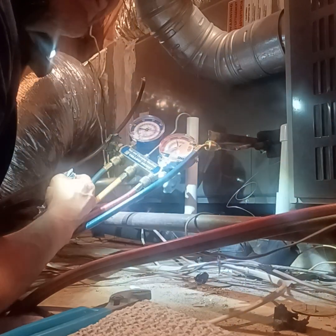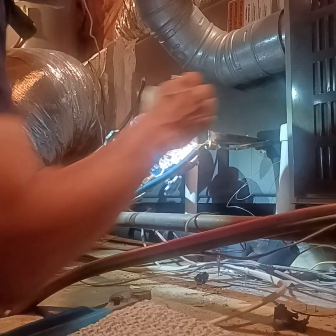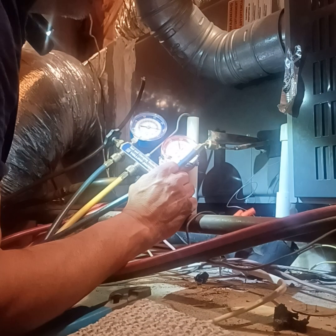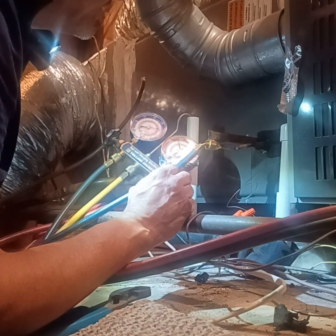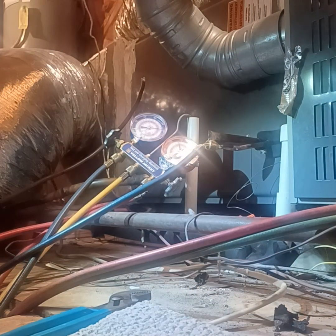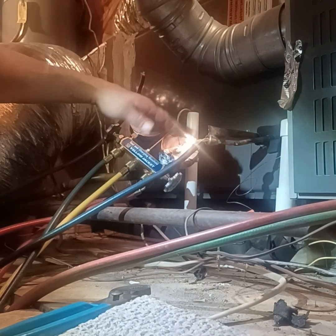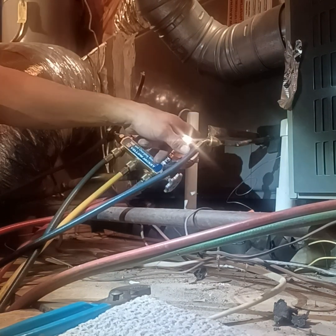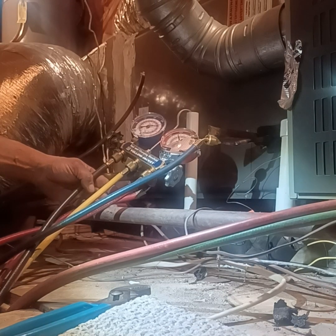All right, all we got to do now is leave it pressurized and then mark where it's at, and we'll know. Check it in another day or so, unless it's that obvious. Sometimes it is. And that's that. Pressurize it. Whenever it stops, you put your piece of tape across wherever it was, and come back in a day or so, pressurizing the coil.